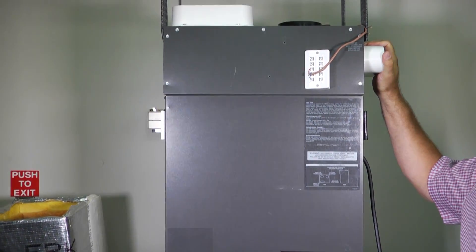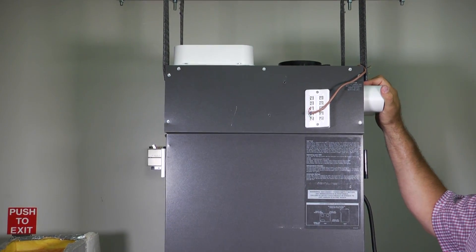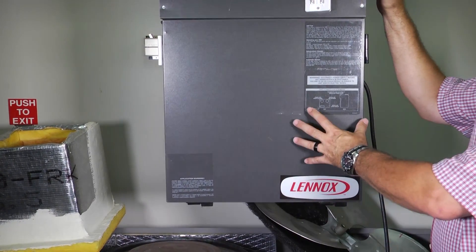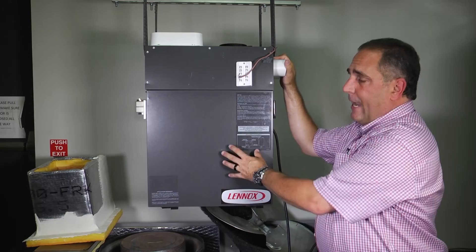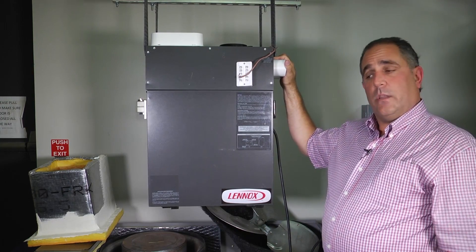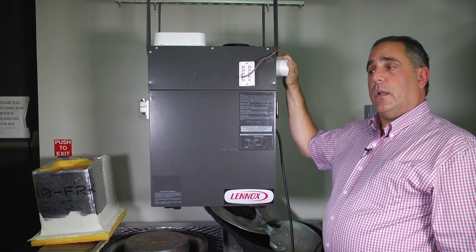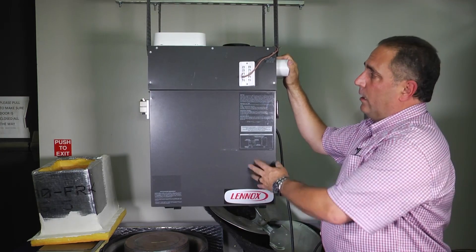When we talk about an enthalpy or an HRV system, people say to me these don't work in our area. But there isn't an area in North America where an HRV wouldn't be a benefit to the homeowner. In places with high humidity levels in the wintertime, the HRV will deal with that. In places where it's warm and you're running your air conditioner all the time trying to dehumidify, your enthalpy recovery ventilator will work for you. Anytime we want to talk about fresh air in the house — which is one of the key ingredients for a healthy climate and a healthy home — is making sure we get proper air changes. And if you follow ASHRAE standards, an HRV or an ERV is the way you're going to want to do it.